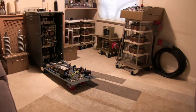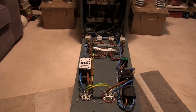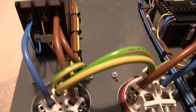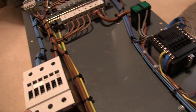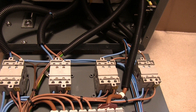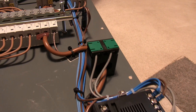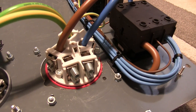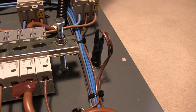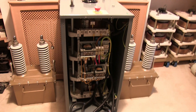We've got some good news — this 100 amp variable voltage transformer is now finished. Quick look at the panel: input goes through a 140 amp contactor via emergency stop, circuit breakers, four switches to select each one of the variator toroids, balancing transformers, 100 amp output going through a CT isolator, output meter, and a couple of small control fuses. Job done — I think we need to turn it on.